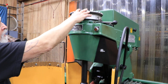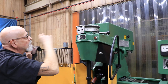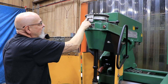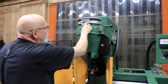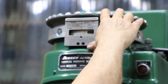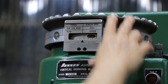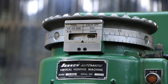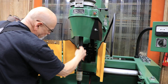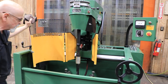Up here is your down feed — I want to call it a hand wheel, I don't really know the honing terminology. But when it's running, it's going to feed with the P28 type tooling. Each division on here is going to be 5 tenths. As this is clicking down, it's moving toward the click-off point at zero where the feed is going to stop. Each time this is moving, it's actually moving like a piece of hex bar through this shaft and actually expanding the stone on the end of this mandrel.